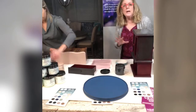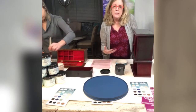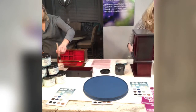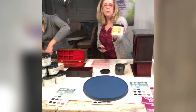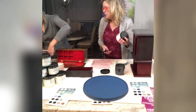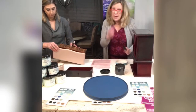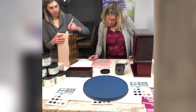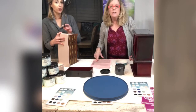And if you want, when you finish doing 2 coats of paint, if you either give this as a gift or you sell furniture, you can add a top coat. For instance, you can use the Dixie Belle clear coat on the top if you want a sturdier finish, but you don't have to. It's just an option for extra security. But like in a high traffic area. Yeah, and one important note, it does take, I believe it's 21 to 30 days, what is it? Yeah. 21 to 30 days to cure.